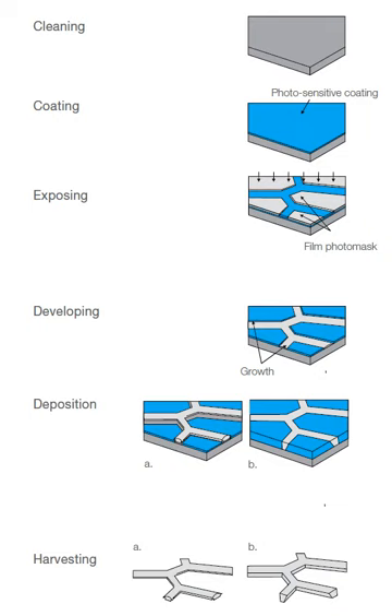Tolerances of 1.5 to 3 nm have been reported. A wide variety of shapes and sizes can be made by electroforming, the principal limitation being the need to part the product from the mandrel. Since the fabrication of a product requires only a single pattern or mandrel, low production quantities can be made economically.